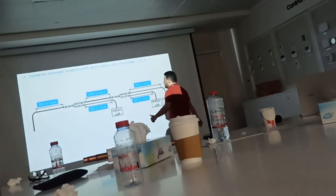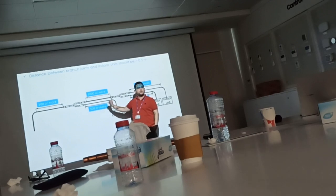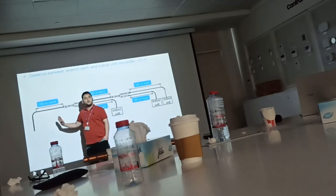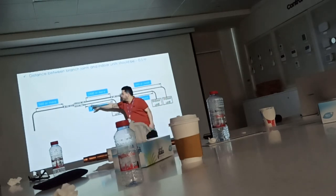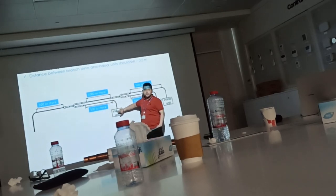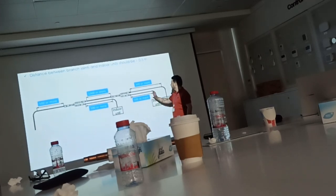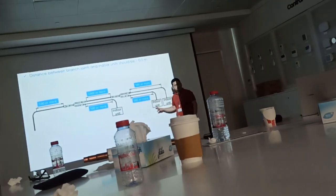Okay? Between Y joint and Y joint, there must be minimum 1 meter. Y joint to Y joint. Before Y joint, minimum you need to secure 50 centi straight. Okay? Before bend to indoor unit, after Y joint, minimum 50 centi, then do the bend. Okay? Tamam. Here also, 50 or more, 50 or more. Done?